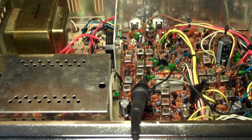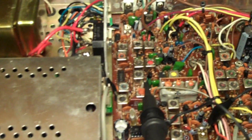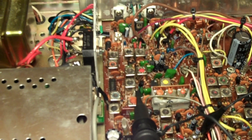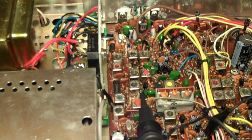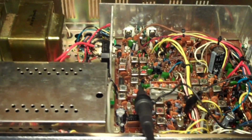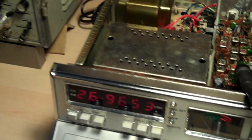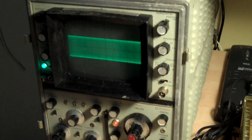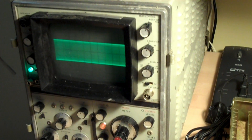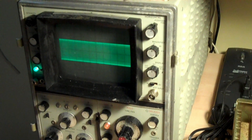As you can see with the scope probe here, I am hooked up to test point one. I apologize — this camera doesn't have a focus and doesn't work perfectly at macro stages, but that gives you a rough idea. I'm on channel one. The reason we need a scope is we get a signal like this, and we want to adjust our coils and inductors for maximum signal. There are a number of these test points that we need to work through.